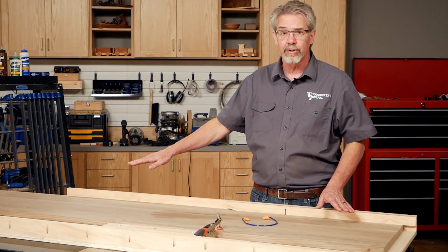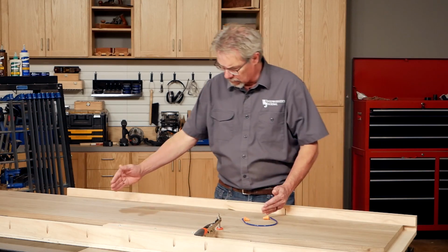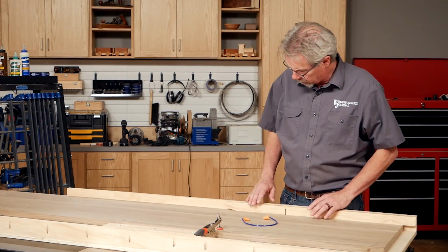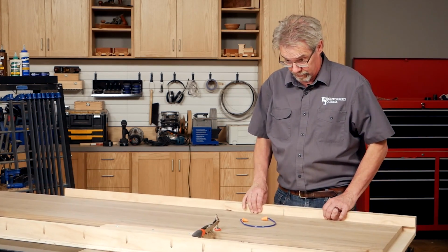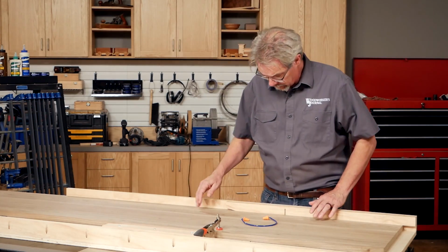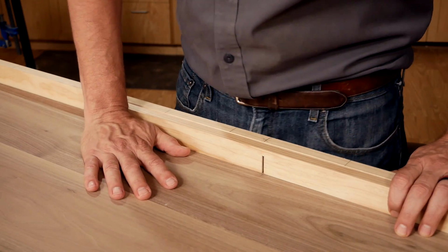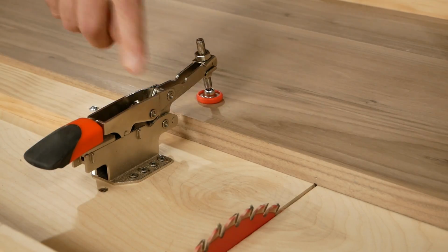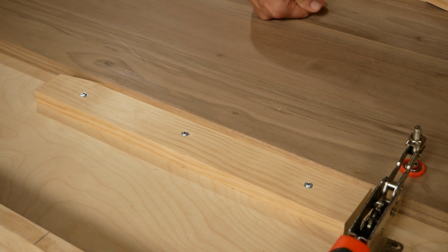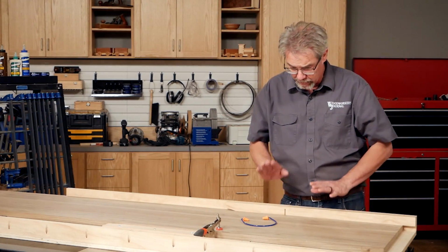So we've created our glued up panel to cut the waterfall joints out of. I'm going to cut a side, the top, and then another side so that the grain can flow right through it. Now, you might notice this really large crosscut sled. The reason why I'm using that is it helps make the cuts more controllable. In addition to the sled, I have a hold down cleat here, which holds the board tightly to the surface. I have a hold down clamp here, does the same thing on this edge, and then I have another cleat that holds it tight to the fence. All of those things take those problems out of consideration for me, so I can just concentrate on making a good cut.